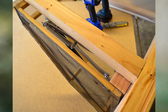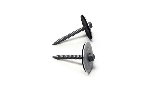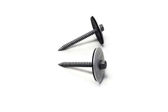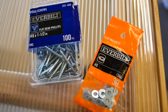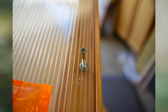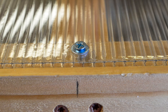With the assembled opener mechanism mounted in the pocket and attached to the lid, I attached the polycarbonate panel to the lid frame. There are special screws with rubber washers built into them for installing polycarbonate panels, but they weren't available locally, so instead I used number eight one-and-a-half inch screws and number eight washers to mount the panel to the pre-drilled holes in the lid. I was careful to not crank the screws all the way in, crushing the hollow panel — if there's a bit of a concave divot, the screw needs to be backed out until it disappears.